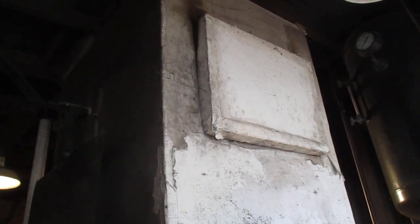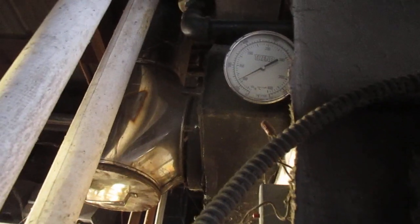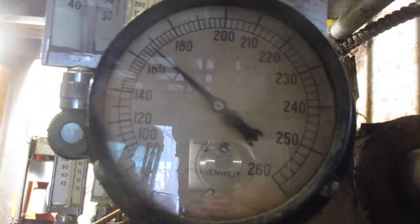I've shown cleaning the tubes out a couple of times before. There are 60 tubes in there. This is what they call a return-tube boiler — the fire goes up and climbs up the back, comes up through 30 tubes one way, then goes up and returns back and exits out the breach up there. My stack temperature right now with that little bit of flame is about 200 to 230 degrees. I'm down to 168 in the boiler so I'll throw a couple more little sticks of wood in to maintain temperature.